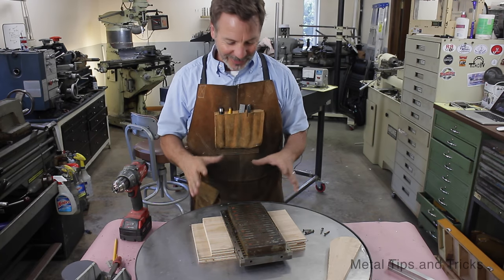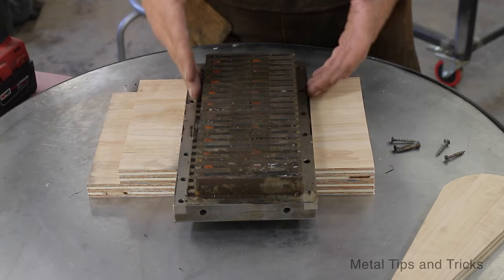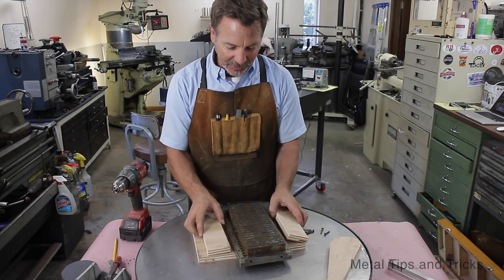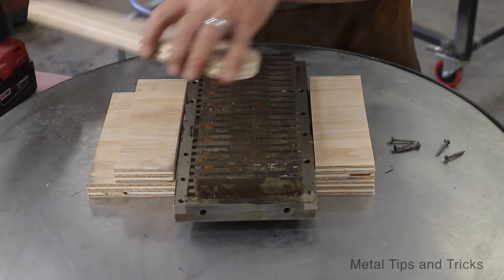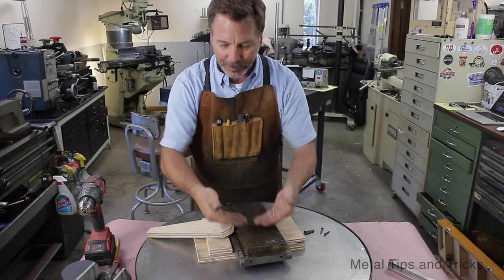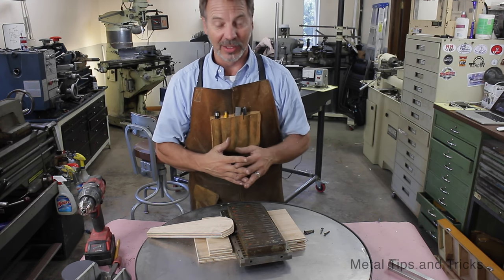The trick now is getting this magnet off of the top plate, and it's not easy. What I'm going to do is a lever action. I've got a piece of plywood down here and we're going to screw a couple others down to it, then set up a cam so we can inch it over — similar to sliding it back and forth with the system already in place, but we just have to move it a lot longer distance.